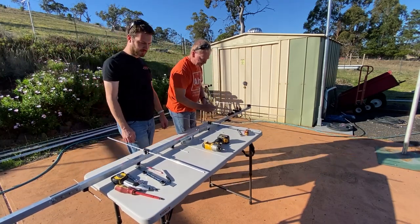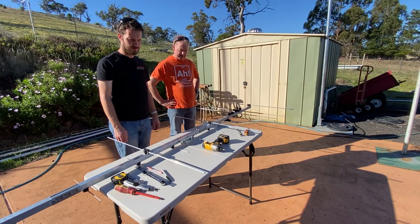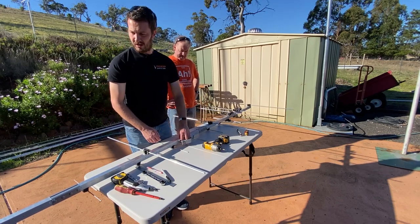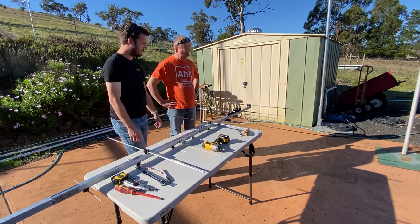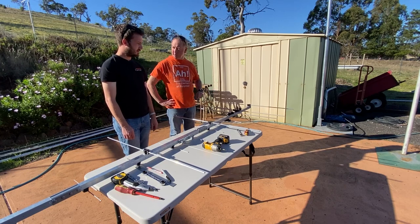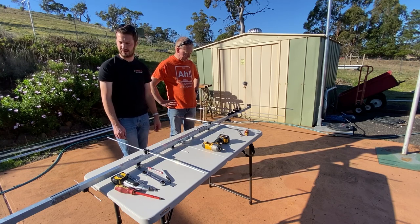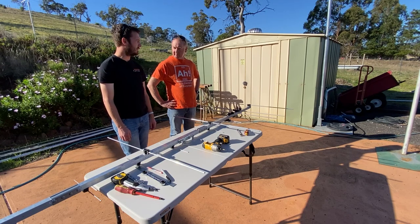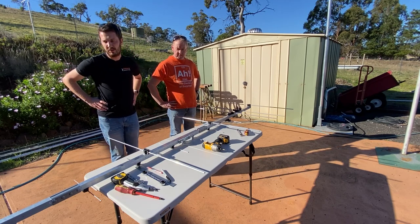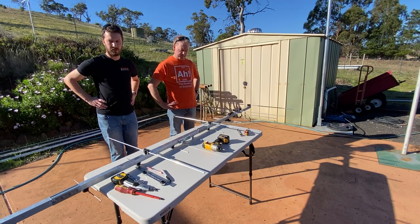All the elements are on. What did that take us? About 20 minutes? Half an hour? So not very long at all. Now we'll put it on a temporary mast and run some feed lines. We're going to need two lengths of feed line. They're both N connectors. It's probably worth mentioning that the 2 metre and 70 centimetres both use N connectors. If we chuck this up in the air on a pole, and we do have a beacon nearby which we're going to point this towards, we can do a front to back test, and we might also do an SWR test.